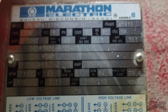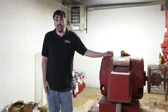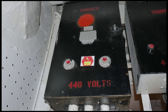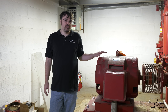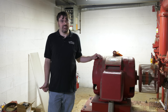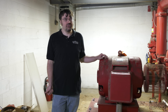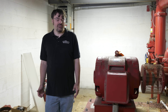One thing you'll notice about this motor is that it says it runs on 460 volts even though we're supplying 480 volts. It's the same reason why all the motors and danger signs on a battleship say 'Danger: 440 volts' but the switchboards themselves operate at 450 volts. Everything is rated lower than the supply voltage because it's really hard to control voltage in a large power distribution system. Wires have resistance, inductive reactance, and capacitive reactance. By the time the voltage reaches the motor it might be down to 470 or 460 volts, and motor manufacturers know this, so they rate their devices at 460 volts when you have 480 volts to give you that leeway.